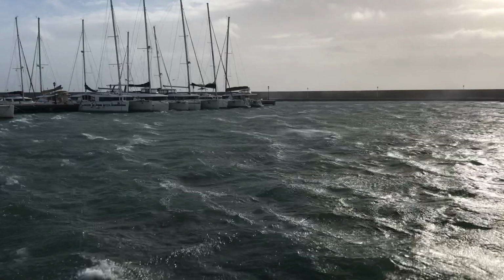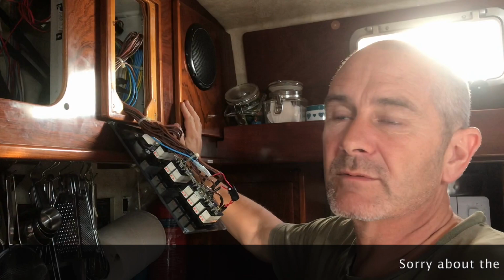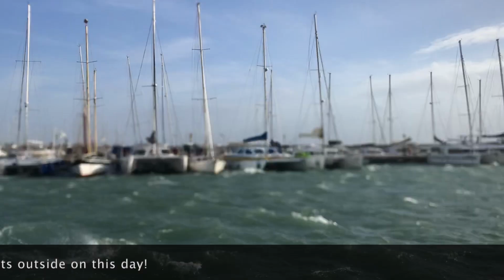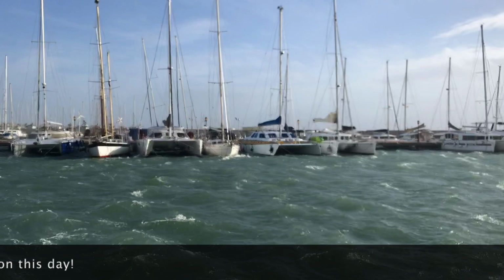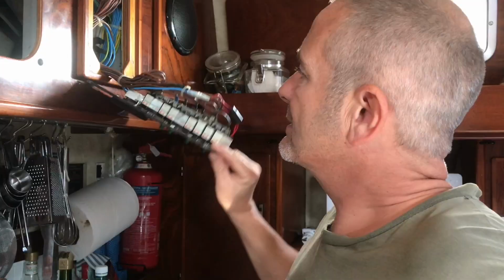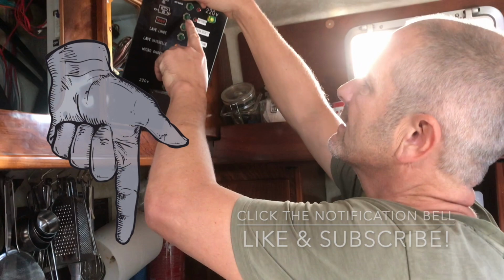We woke up this morning and the electric had tripped. And we weren't sure why. We thought it was the RCD, but the RCD's okay. And it was tripping the pod as well. So to cut a long story short, we unplugged everything to try and isolate where it was, and it was still tripping, so we couldn't work out what it was. But the only thing that's still hardwired into the consumer unit is the battery charger and the hot water.